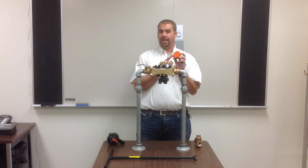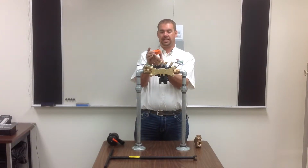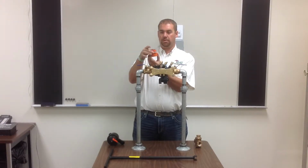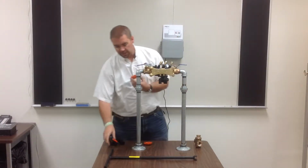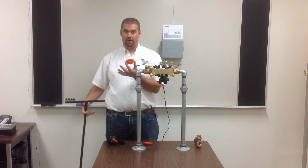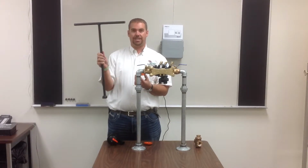your stop and waste cap. Okay? This is the cap on the top. It actually has a locking feature in it, so you can twist it and it will click once and then it comes off. Once you find this cap in your yard, some are yellow, some are orange. Once you find that, you will have been given a stop and waste key.